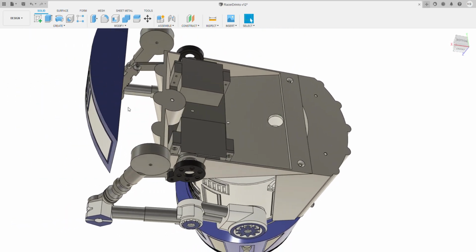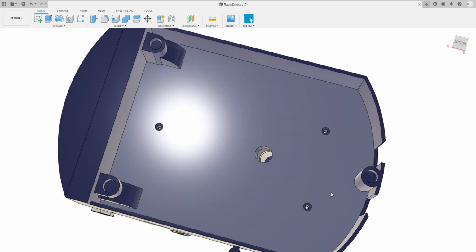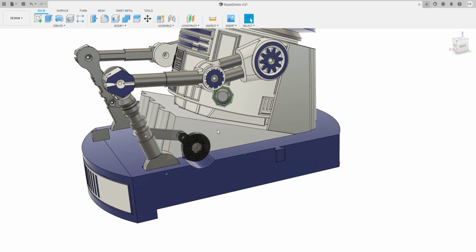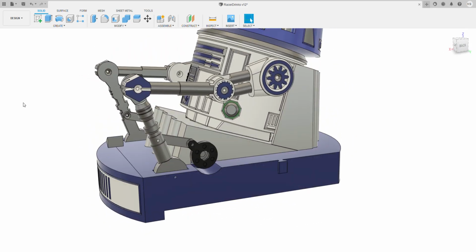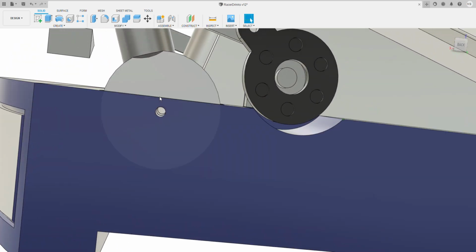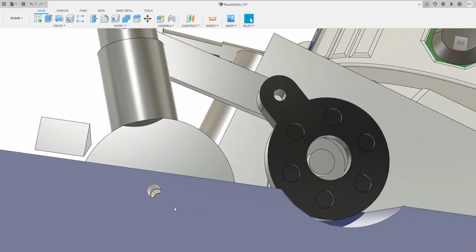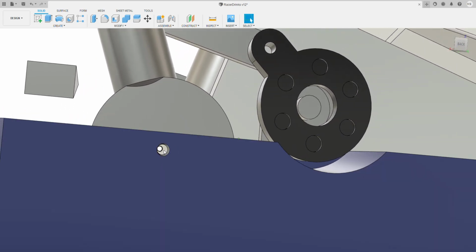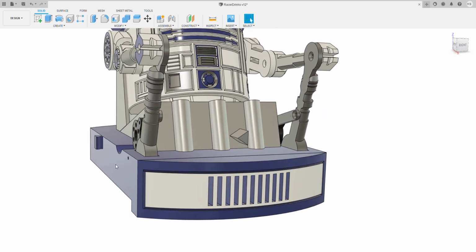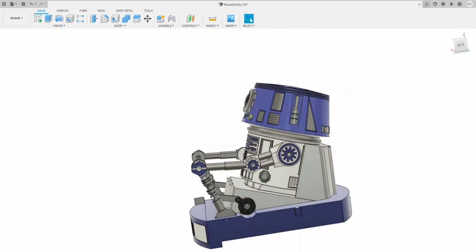Once you've done that, the whole thing then bolts onto the base in three areas, one screw there, one screw there, one screw there. They all come through from the bottom and they bolt the seat into place. Once the seat's bolted into place, the final thing is we need to secure these little steering arms. The way we do that, similar to what we did with the can mechanism, is we drop a piece of flex filament right the way through there to the other end, blowtorch or match, melt the end of the filament and squash it in a little bit, and that makes your whole segment.